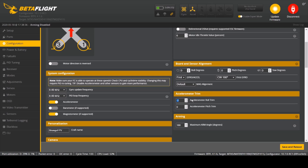As you can see, minus two is in there because we pushed the stick to the left when using the transmitter. Negative numbers are for the left, positive numbers for the right with roll; positive numbers are forward and negative numbers are back with pitch. In my case, I know this needs to be negative 14 on the roll — everything else is fine. If I save and reboot that, the drone will hover almost perfectly.